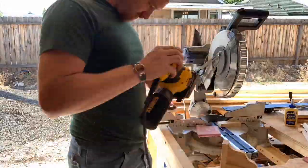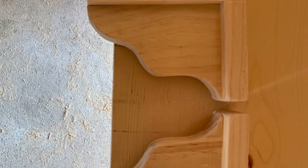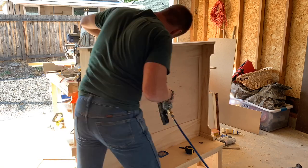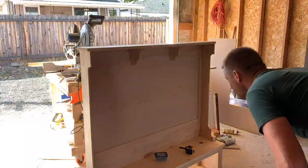Here I'm making some shelf brackets out of wood — if you're interested in how I did this I'm going to put a link in the description. I'm going to use these and glue and finish nail those to the top portions to give it a nice look and keep it with wood. It kind of keeps it all tied together whenever I stain and paint it.